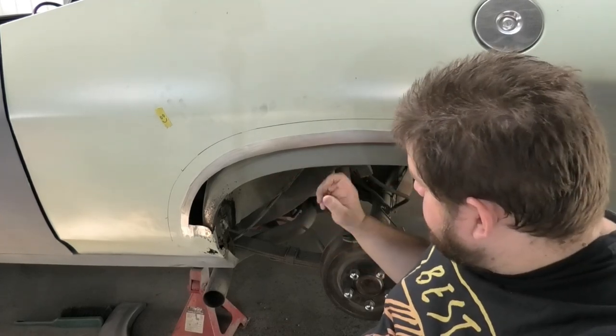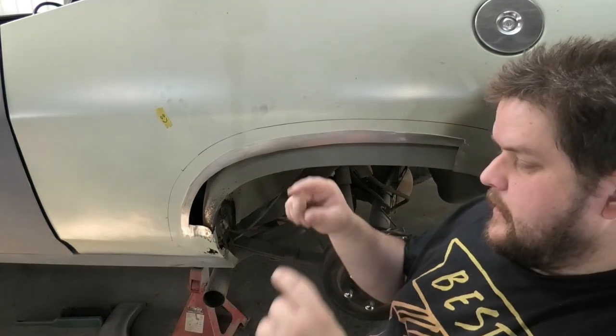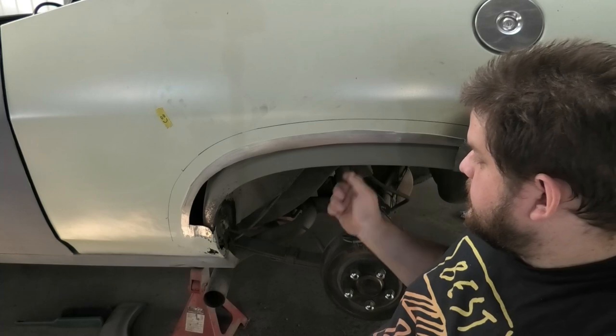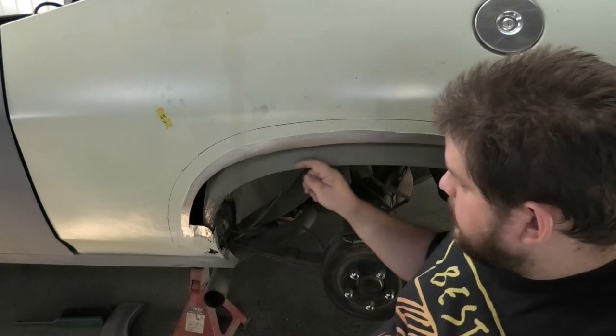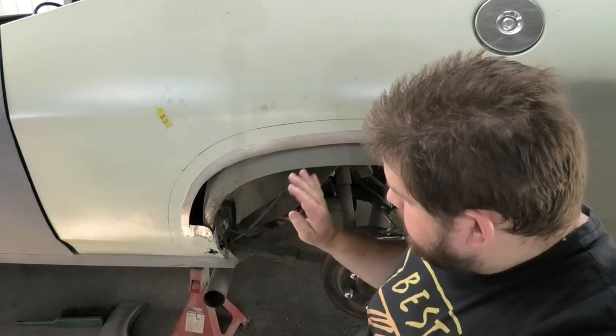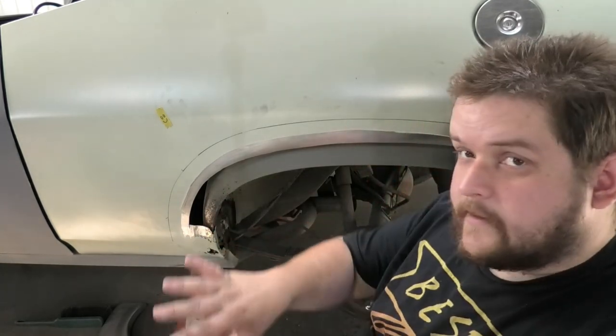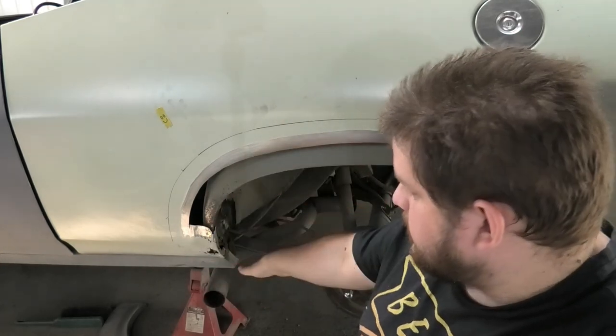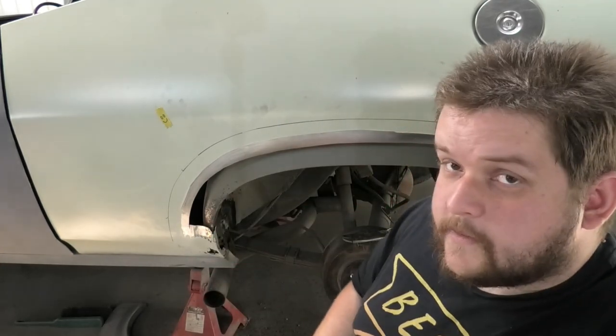So we're going to just copy what we did here with about an inch, and then I think it was 30 mil underneath with a fold, and then shrink it going this way and stretch it going that way. So it has like a double curve in it, so it's got to go down, but it's also got to go tuck under as well, which is always fun.